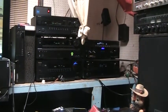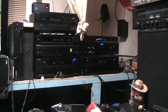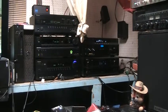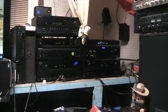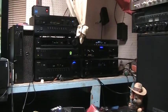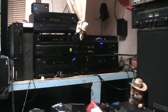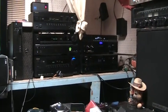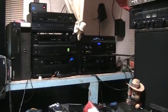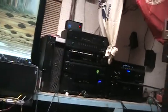The Denon on the bottom is hooked up on passthrough RCAs — like you'd directly connect a Blu-ray player — all eight channels in the back, but I'm only using five of them. The rest are shut off in the menus so I don't burn up my finals. Denons are famous for that: if you leave channels open with no speakers hooked up, sooner or later those little relays fail, and you end up replacing relays or worse, replacing finals.